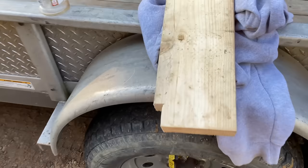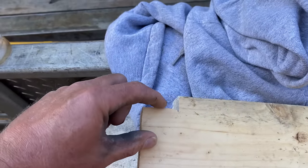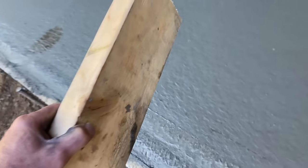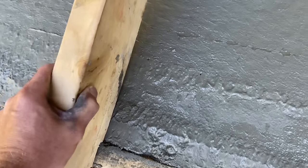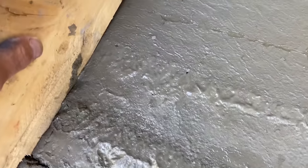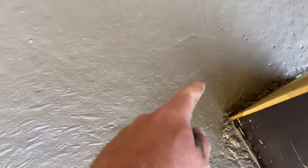There's our line. We make a board like this. We just made one. Usually we carry one in the truck, but take like a 3/4 inch notch out of it. We're going to dig this out. Basically, you want to push that down so it's touching here, and you're going to dig it back to this line, because your door sits in here.